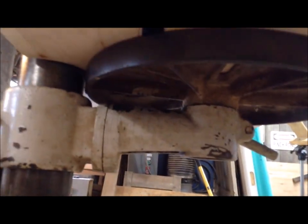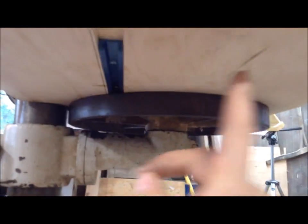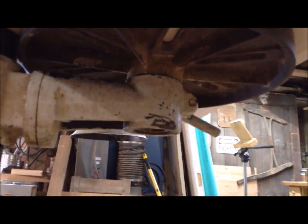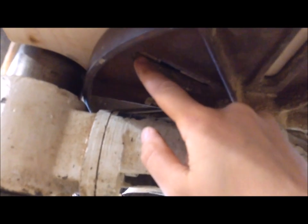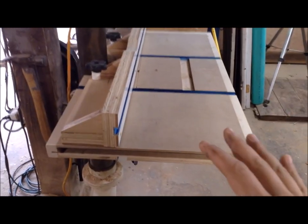I need about 3 inches of clearance to clear the column. When I moved it to the front, I noticed there's a lot more play in the slotted holes than I originally assumed. Since these holes are a little over 3 inches, if I make a new dado and center the track over the back edge, I should be able to slide the whole table up far enough to push it to the side — which means I pretty much will never have to take this off.